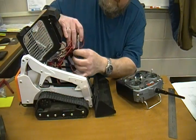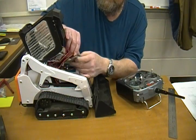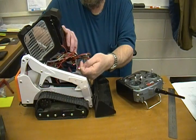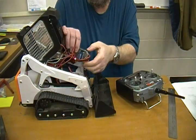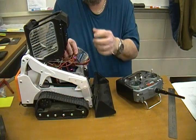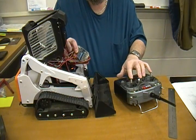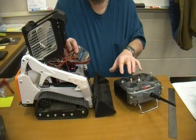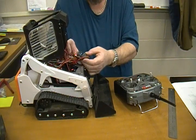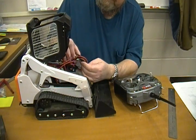On this ESC there's a setting — you have to flip a switch on one of the sides — it's for the tank mode, so you can run two separate motors with two different joysticks, both running forward and back. To go forward you push both joysticks up, to go back you push both back, and to turn you push one up and one down. I don't like that — I wanted a single-stick steering.